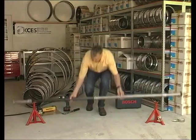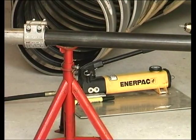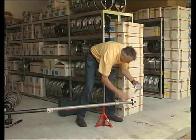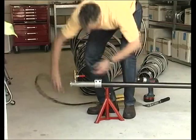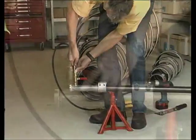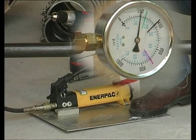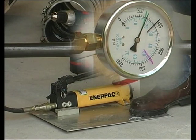To show the robustness of the finished connection, a pressure test will be performed. This pipe has been filled with water and a pressure gauge is attached to one end and a pressure pump will be attached to the other end. Pressure is now applied. At this point, the nominal pressure of 16 bar or 232 psi has been reached.